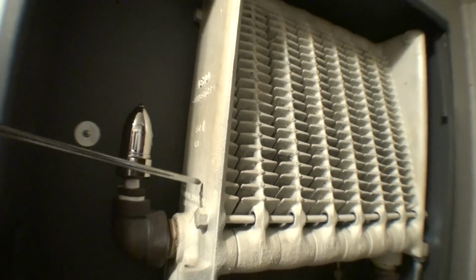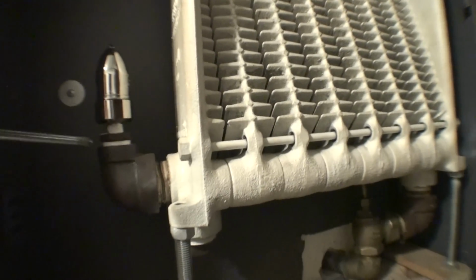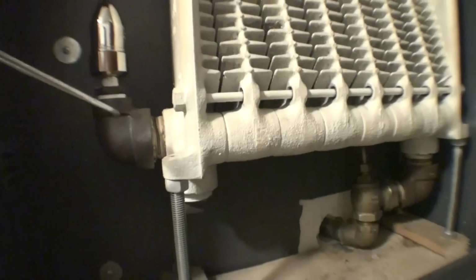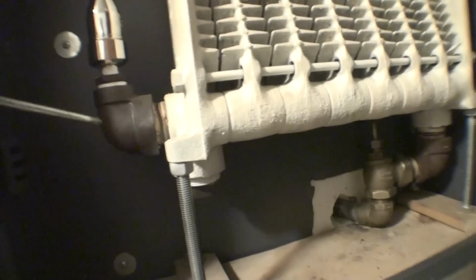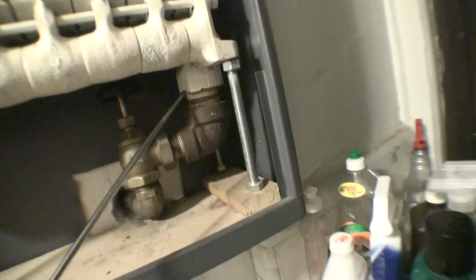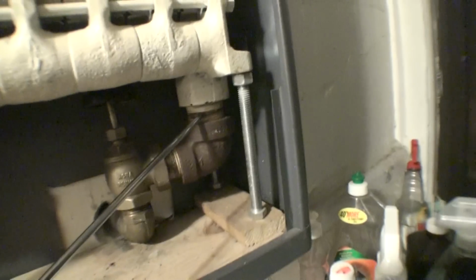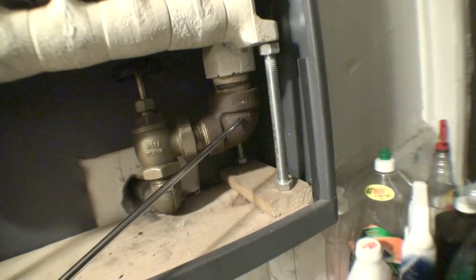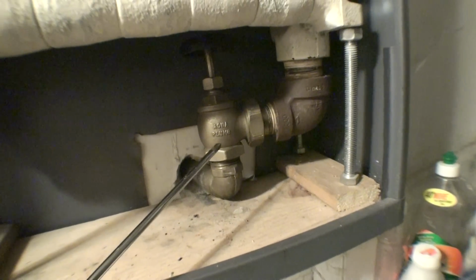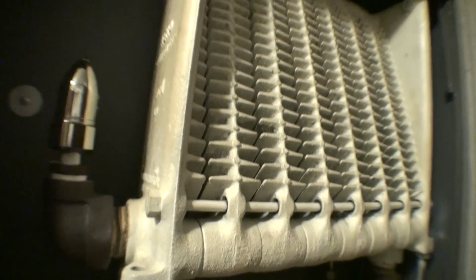And this was once set up on a hot water system. Now they do make some of these, or they made some that had an air vent that was located toward the bottom. Unfortunately, I didn't get my hands on one of those, so I did what I had to do to make sure that this was going to run in my favor. So I decided to cut this plug out and install this nipple and install this air vent along with the elbow. The same thing down here, which did have a bushing in here with half-inch connections because it was on a hot water system. Basically what I did was I cut the bushings out on each end, and install my 1.25 inch nipple with my 1.25 inch by 1 inch elbow along with my 1 inch cutoff valve. And the radiator works sufficiently, it works beautifully, it heats up the room significantly, and this is exactly how you're supposed to have a one-pipe radiator setup.